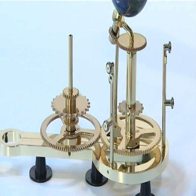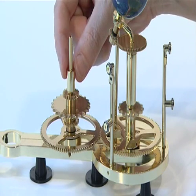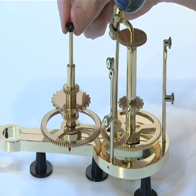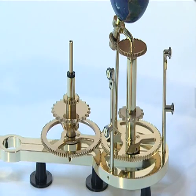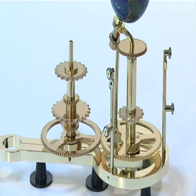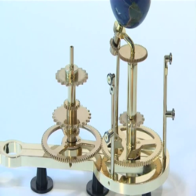The seventh phase of Stage 2 adds the 18 tooth chain sprocket supplied with Issue 16. Slide the long brass spacer onto the central shaft so that it sits on the 23 tooth gear fitted previously. Slide the small plastic washer onto the central shaft. Slide the 18 tooth chain sprocket onto the central shaft ensuring the locking jaws face upwards. Slide the small locking spacer onto the central shaft and engage its jaws with those of the 18 tooth chain sprocket below.